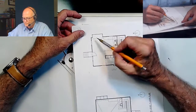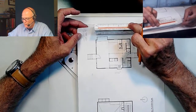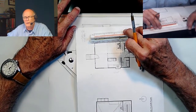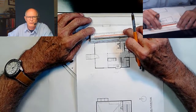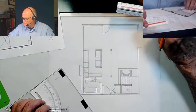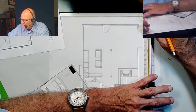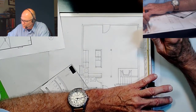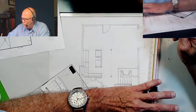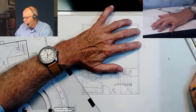Now what you're going to notice here is there's divisions across here. So let's take a look at what those divisions look like. There's some odd number, wouldn't you know it? Okay, so I'm going to take the total inside dimension, and it looks like it's 8 feet. You could break out the calculator, 96, is that right? Yeah, 96 divided by 3 is going to be like 32 inches or something like that. So you could measure it, and that would give you 3 equal divisions. Or you could measure every window and do it that way. I'm going to go ahead and place these in at the 32 inches. So there's 1, 2, and there's 2. And then I'm going to come over here and go 1, 2, and 32. Okay, so we could probably measure these in a bit, but I think we're pretty dang close. Okay, so there's our 3 divided elements.